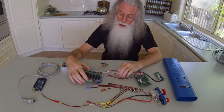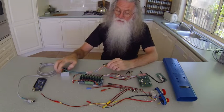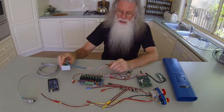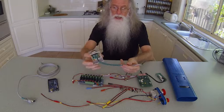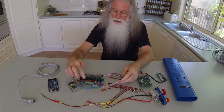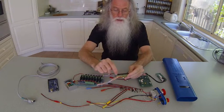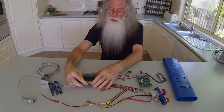Now the relay board is connected to the push button board, which is fine, but then I have to run the cabling from the relay board to the Arduino, and that's going to be, say, 1 metre away. And running a lot of cables, you have different solutions. So the one I've come up with is I've used a D9 adapter module, and there are 8 relays plus a ground, so it happens to be 9 wires. I then made up a connector. There will be a video on how to make up this type of connector that then screws into, or is fitted into, the relay board like such.